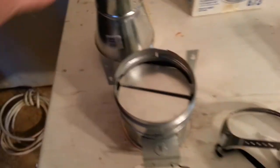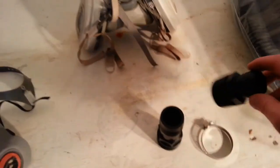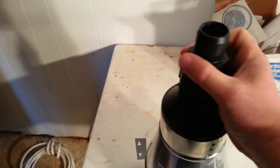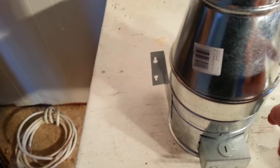The fan is going to mount vertically on top of that box, and it's going to blow air. I'm going to hot glue gun or silicone this setup together so it pulls air out of that box. This inch-and-a-half to inch-and-a-quarter fitting, which came with the kit, threads in here. I don't plan on sealing it too tightly because if I need to replace it, I don't want to break it — so it'll all go together dry, except possibly the fan-to-galvanized fitting.